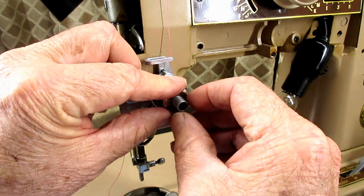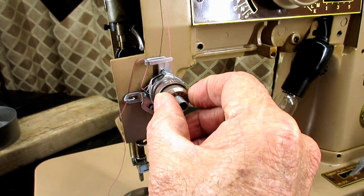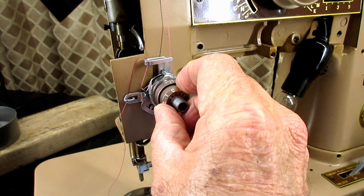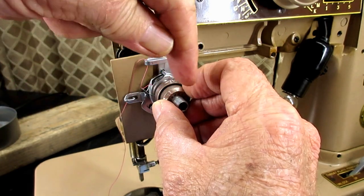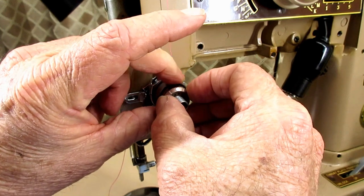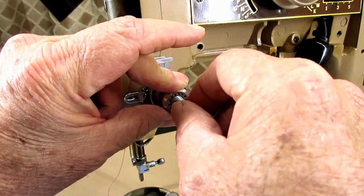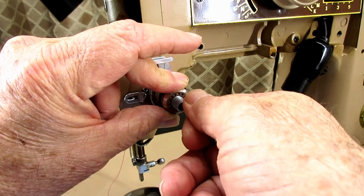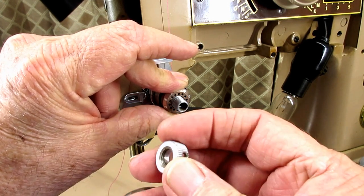I'll put it up there at about 1 o'clock and hold it up against there, making sure I'm seated, then turn it to zero and make sure it stops. It stops a little bit past the zero, so that's good. Now if you notice on the indicator there's a minus with a vertical line and then the plus sign. If you put your zero lined up with that vertical line and hold the numerated dial right there — because you can actually turn this past zero — at zero I'm going to have about 15 grams, which is what the spec says.